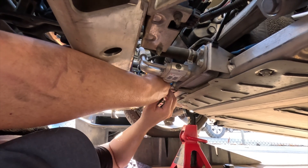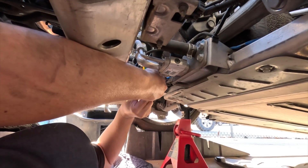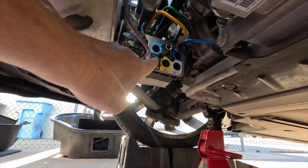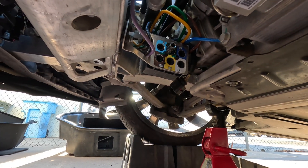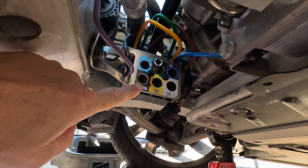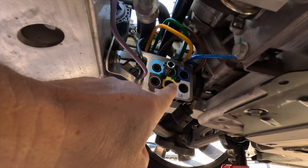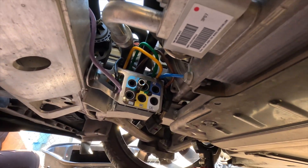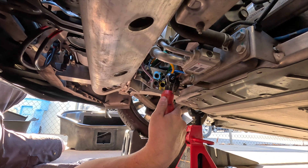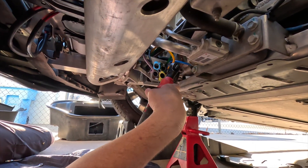Here we go. You see the face plate there? We're going to orient the face plate to the colors - it makes it a little bit easier. There's a face plate on it, and the solenoid is being attached to that face plate. We're going to remove that solenoid - there are two bolts keeping the solenoid to the face plate. The face plate has the color coating on it, so you can never mistake it. As long as the connector is on the right side and you are connecting all of the pipes correctly, you should be fine. We take all of the bolts out from both sides and then we can take the solenoid out.